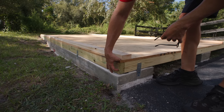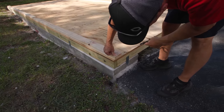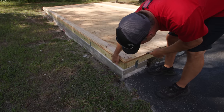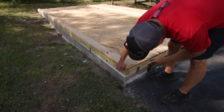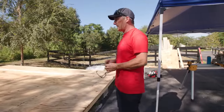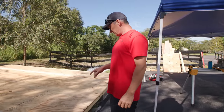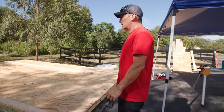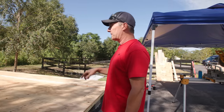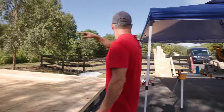So my total overall length of stud ends up being 88 inches if I keep the siding 3/4 of an inch up. And then there's gonna be trim boards that cover out here anyway, so you won't even see this reveal. So anyway, I'm gonna cut all the studs at 88. So I gotta do my stud count here. I think we need, should be 11, 12, 13. So cut 13 studs, get this wall nailed together, tip it up, brace it off, get it nailed down, and then we'll build the second one over here, and then we'll do the little short walls.